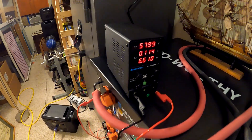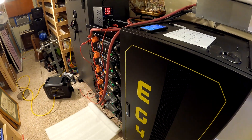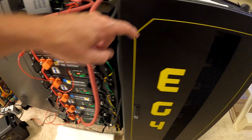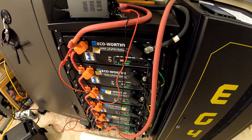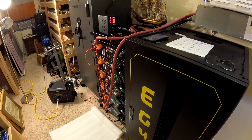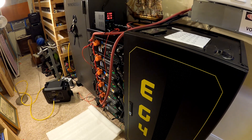I think I'm going to call it on the top balancing — I don't think I got it quite right. If I did another round of this, I think I would cut the current earlier and take it really low, and just take like three days — that might work better. But I think this is good enough for now. This guy has been used for two and a half years and it's perfectly top balanced, because I always get it to 100% at least three, four, five times a week. So I think if I do that with this one, it's going to be just fine. We'll see how it goes after a month or two. But I'm turning my attention now to hooking these together. That's it for this one, guys — thanks for watching, and I'll see you on the next one.